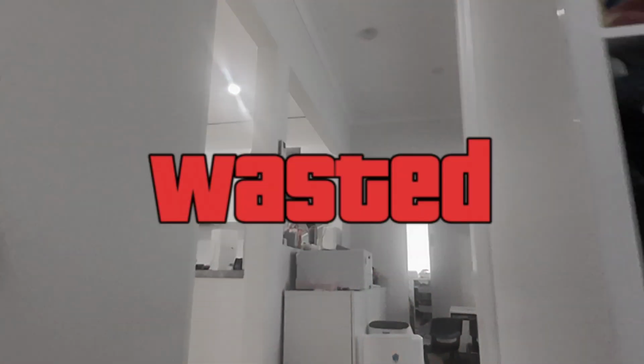Alright, so you can see what happened there. It died in the air. So the air unit cut out, it browned out, and it fell out of the sky. The flight controller was still going, but as you can tell, the air unit then died out, and it booted up again, and then I was able to fly again for another second, and the same thing happened.